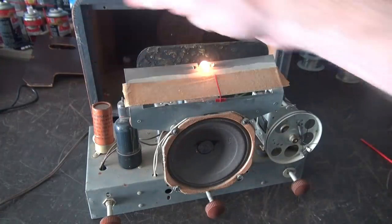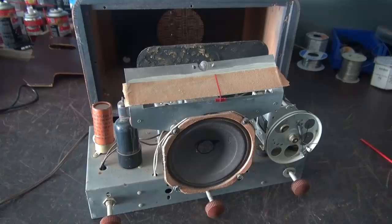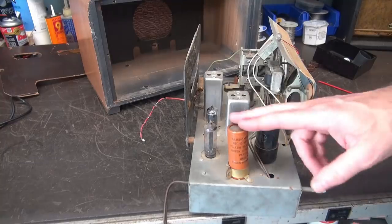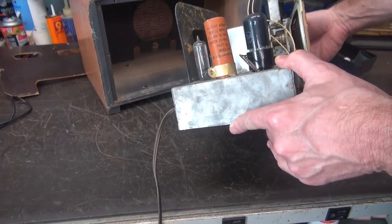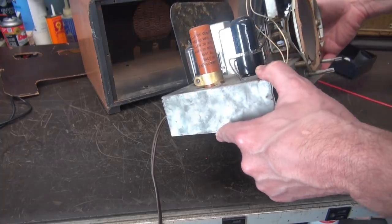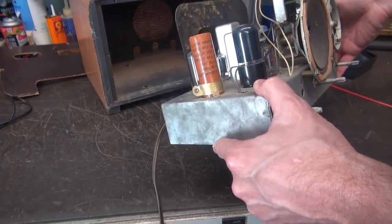And that is Mr. Filter Cap. Let's kill it and put in a new filter cap — that seems to be the common theme with these old radios. So here's the main filter cap. She's got a 50 microfarad section, a 30 and a 20, all at 150 volts.